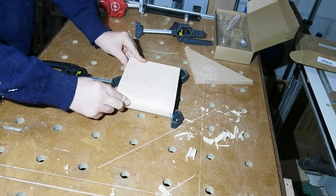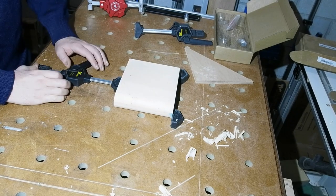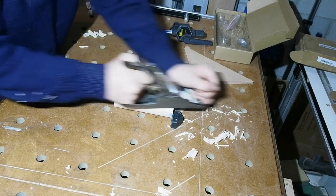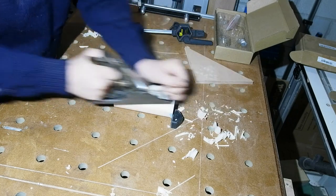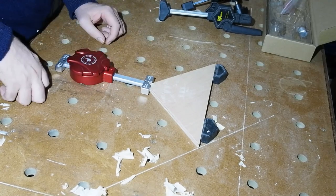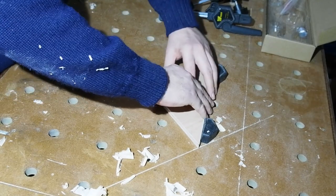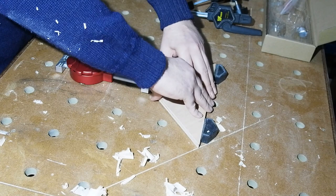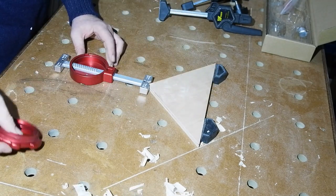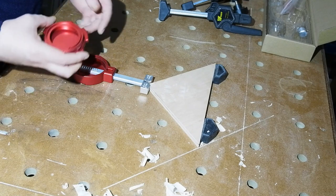This is one of my other linear clamps, something I've reviewed in previous videos. These come with a star knob that attaches underneath - without it, this one will lift too. Fit the star knob to the underside and it holds fast. Even though I'm certain it can't apply as good a clamping force as the shiny new Hongdui one, I'm able to plane away the previous gouges with no problem. This is in fact the setup I use most often when planing. One tip: rather than turn the top 50 times to reach the clamping point, just lift the top off, move the clamping bar to position, replace the top, then turn to apply clamping pressure.